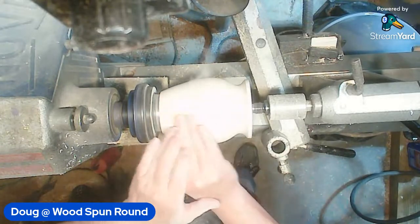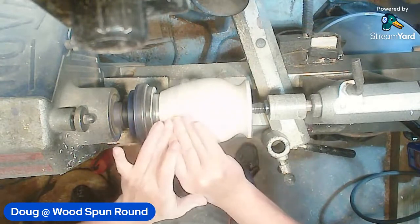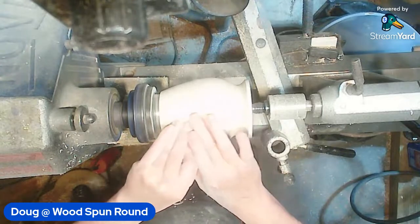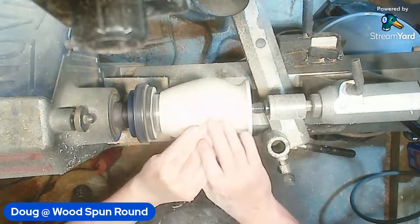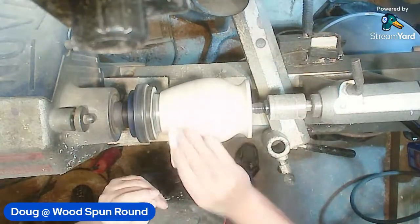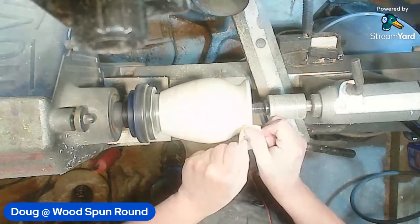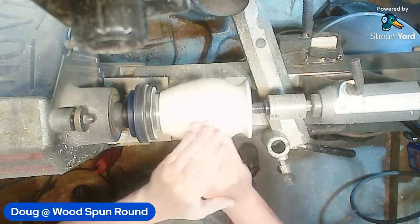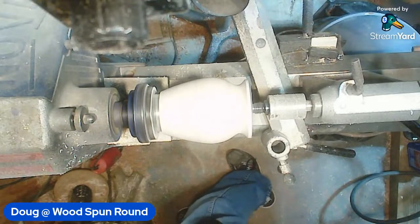Because if you're turning a vase in spindle work, it's usually straight after a fillet or a cove. So you turn a bead, a fillet, cove into a vase, and the vase goes into a taper. I like that combination on a finial. That's a great combination. The vase part is also known as the onion. Yes, the vase is the onion. This would be the big part going slimming down. I quite often speak to Steve Jones and Richard Finley, asking them questions about work, and we have to call things different things to each other because we all live in different parts of the country. So what Steve calls a vase, I'd call an onion. What he calls an onion, I wouldn't call anything. I didn't have a name for it.